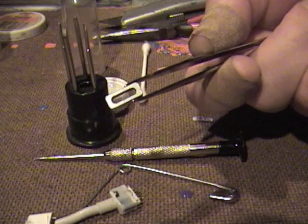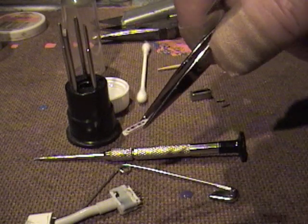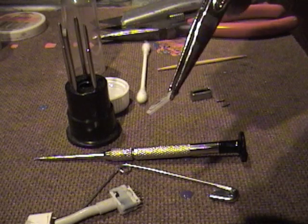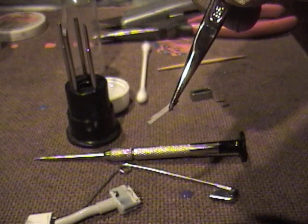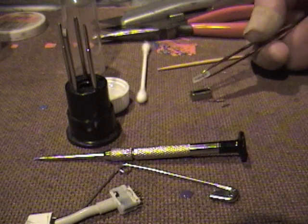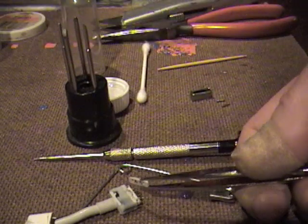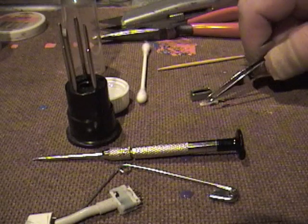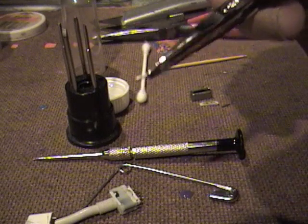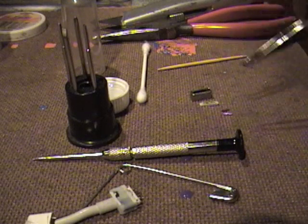The pins stick out of that side. The piece that the pins come through looks like this, and there's the profile — it's got a raised piece where the pins come through, and that fits up into the magnet. The flat edge goes against the power and the pins. There are two tiny brass pins — one, two — try not to drop them or lose them. There's two of them and we're going to put those back in.